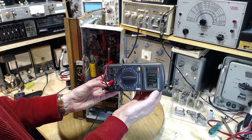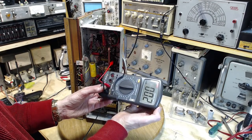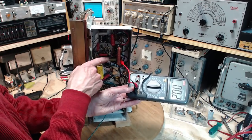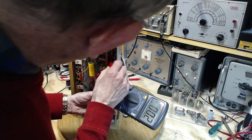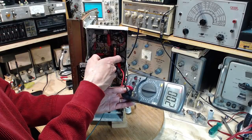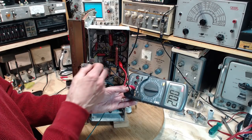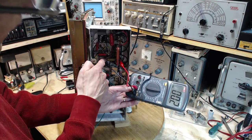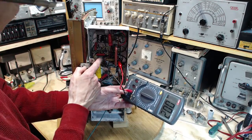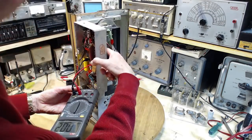Oh. That doesn't look right. So there's a capacitor here. I'm connected across it. It's a major B plus. The red lead is connected to a capacitor with a lot of red wires coming off of that terminal. There's another wire here. Where is it going? I think it might be headed to the speaker. Yeah, it looks like it's coming up into the output transformer.